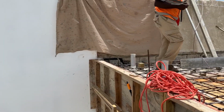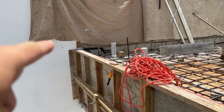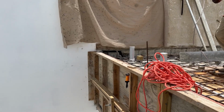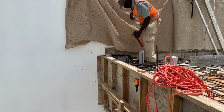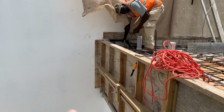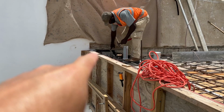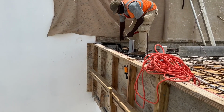One thing I didn't look at was in there. Beckles, one thing we didn't think about, look in there, look. In that block hole, gone right through to the inner wall, look. That concrete pour's in there, that's going to fly down the inside plasterboard. Underneath. Yeah, underneath. So basically the silver thing you can see just where his hand is, that's actually the U-channel on the wall on the other side, which means, yeah, above that block, straight into the plasterboard.